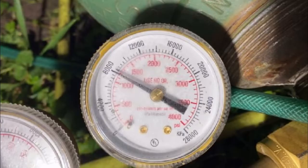So what's the brass tacks? Here it is: we used 450 PSI to pull that off, which brings us to $11.50. I would have to say that this is indeed a practical method. You may not even have to bust out an oxygen concentrator as big as a school bus to do this. I was thinking about making a homemade one from a couple of large tubes with some special valves. It looks like you could do this four times off this little bottle of oxygen — four crucibles of metal, which ain't really so bad.